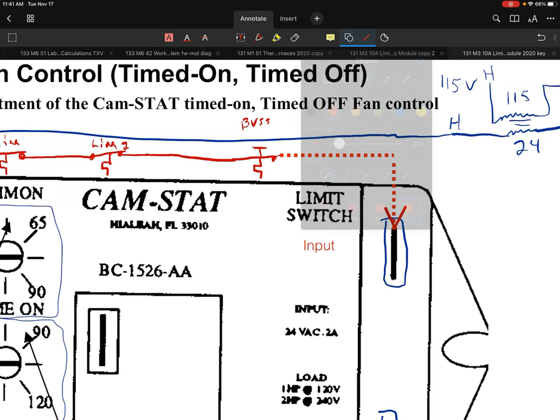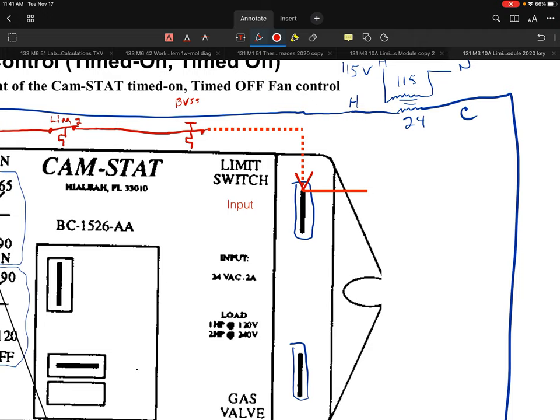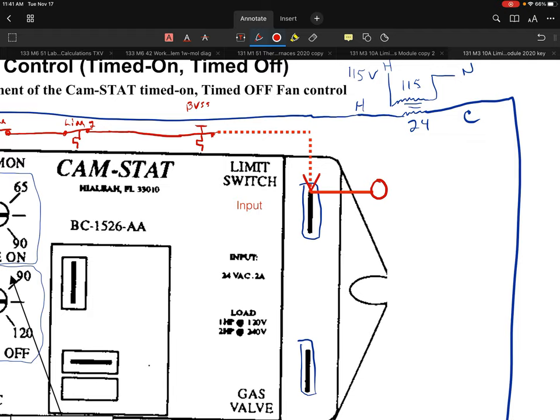And what we're also going to do is I'm going to pull power off of this one, and I'll switch that to solid like that. I'm going to pull some power out of this. Now, off that limit switch input on that controller, I'm just going to draw a little circle with a screw terminal on, and I'm going to identify that as terminal R. Now, terminal R should have some meaning. Typically, that means it's my 24 volt input. Now, my 24 volt power.